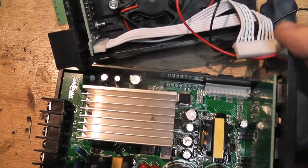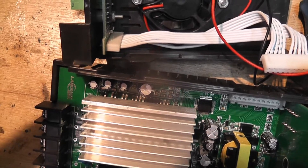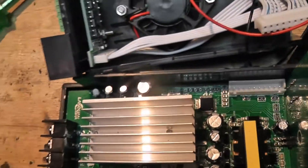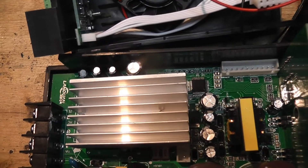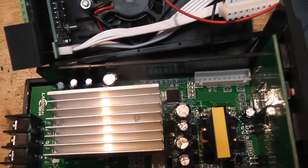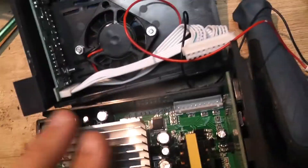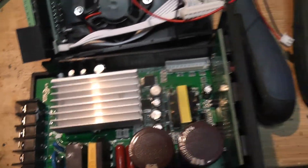It's running an STM32 — looks like the same one as on the blue pill. There are some shunt resistors to measure the current. Under that heatsink there's an all-in-one three-phase IGBT bridge chip. According to the Chinese datasheet it's rated for 600 volts, 15 amps — assuming you can cool it. This one is already warm, so I'm not sure about that 750 watt claim.